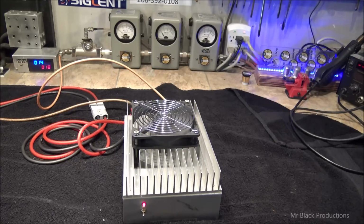To where everything is nice and perfectly in resonance, and it doesn't matter where we use it from 80 meters on up. Do not use this on 160. You will be sad with the results. I don't think you're going to hurt the transistor any, even though it's just right on the cusp of what it should be doing. Stay away from 160 meters with this thing. But then again, I'd love to see a 160 meter mobile. I know they exist. It's going to have a big, long antenna on it. Big, giant bug catcher on it. Big, long antenna. Long frequency.